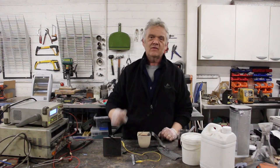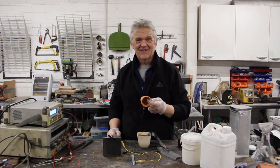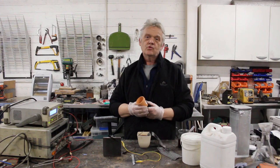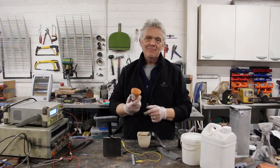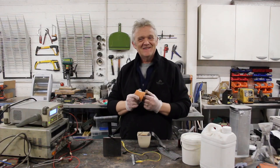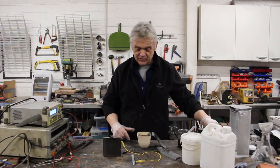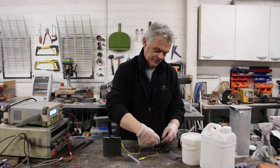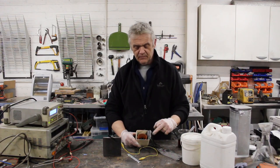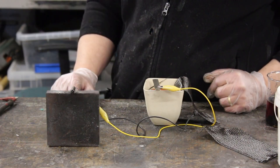Now because I'm sticking a bit of zinc in there along with the carbon cloth, you'd think: how do you stop the two touching? This is something I bought at my local Asda — a tiny plant pot without a hole in it. These are unglazed terracotta, and they are the subject of research right now as an excellent membrane for flow batteries to keep everything separate. So even though this just looks like a normal terracotta pot, it is actually the height of research to use a bit of clay as a separator. If I connect up my carbon cloth and stick the zinc inside the terracotta pot — filled with Lugol's solution with the carbon fibre cloth in the bottom — and stick my zinc in, presto, it turns like crazy.